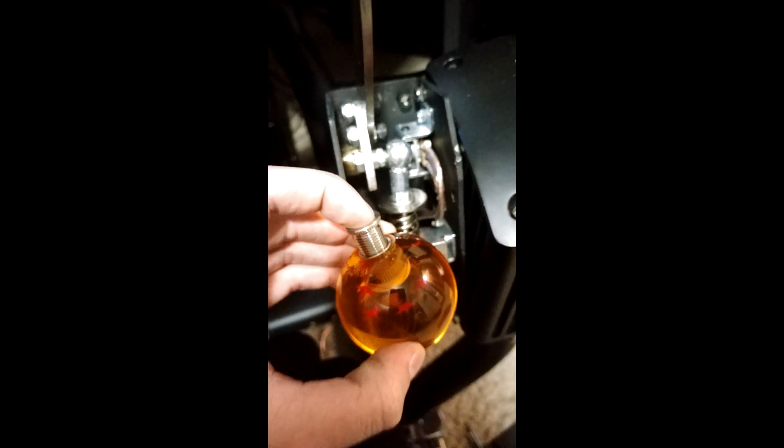I'm going to show you the way this works. Take out these screws, pop this off from the bottom. These will probably look a little different on yours. This top piece is actually plastic and mine ended up snapping, so I took one of these — that's for a shift knob — and a big washer. It works perfect, actually better, because it doesn't flex like the plastic one was flexing and giving me off sensor readings.